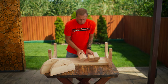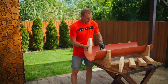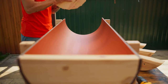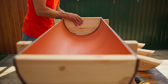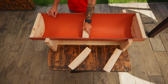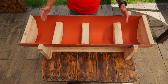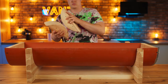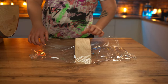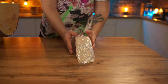Two large semicircles were also carved out of wood, and three smaller ones, but at the same time they're twice as wide. We put half of the pipe on the stand, lubricate a large semicircle with glue, and put it into the pipe. Additionally, we fix them with screws, and put the missing parts in, and our form is ready. But in order to be used, we take some small half circles and wrap them with some cling film. Done.